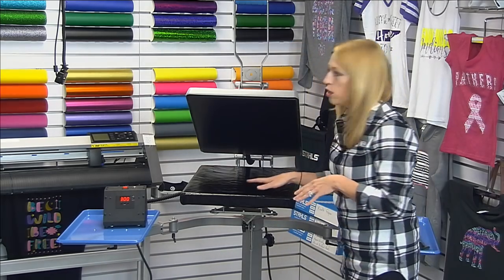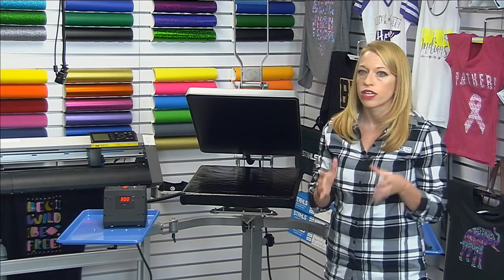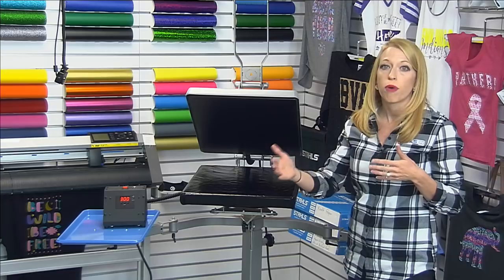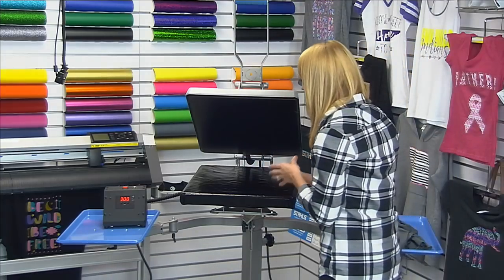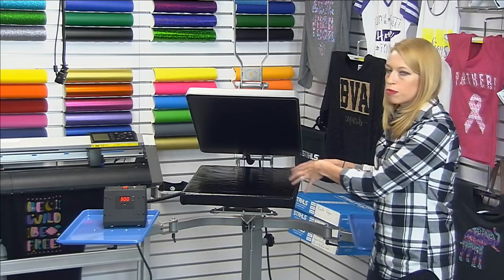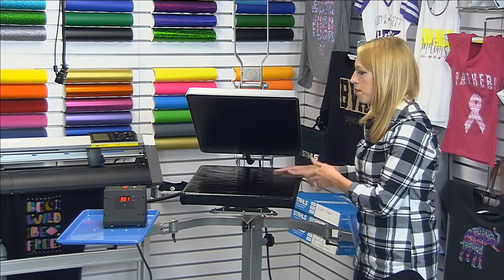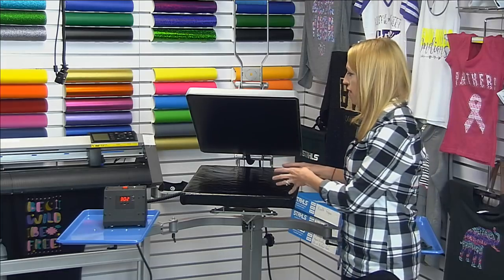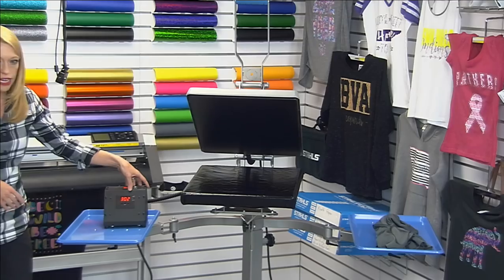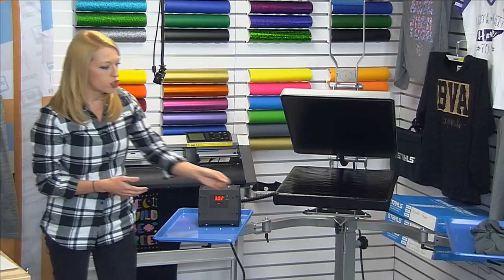Today I'm going to be using the AutoClam paired with the lower heated platen. This is a new innovation from Hotronix that we've shown here a couple of times on the Stahls TV Morning Show on Facebook Live. We are currently taking pre-orders to ship at the beginning of the new year. Just like all of the interchangeable platens on the Hotronix heat presses, this is interchangeable — it completely pops out and drops back in with no tools needed. It has a separate control that operates the heated platen, with its own heating element that winds throughout the machine underneath a Teflon-coated cover.